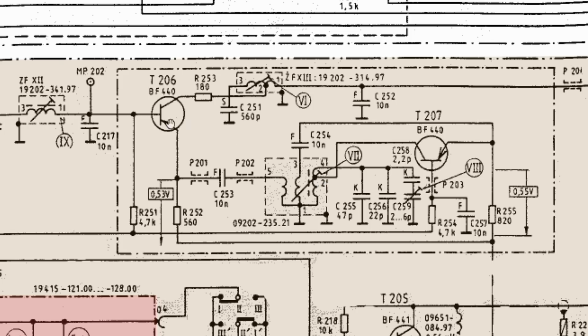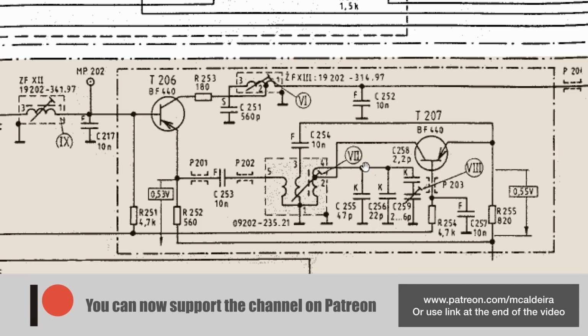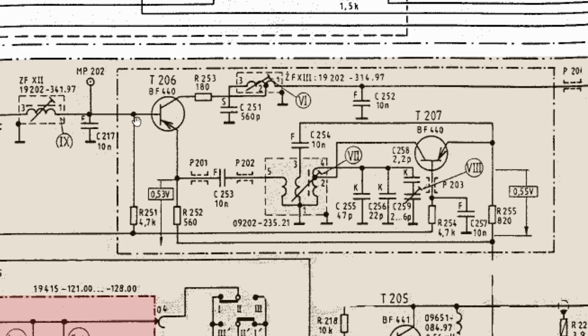And what that's doing is it's taking a 2 megahertz signal, which you are injecting in here. Remember, MP202? 2 megahertz with a 1 kilohertz or 600 hertz sine wave modulated on it, 30% modulation, for example. And that goes through, and provided this thing is producing a correct frequency, provided this guy is producing 2.46 megahertz as exactly as possible, then out here you'll get a 460 kilohertz carrier with the audio tone on it.